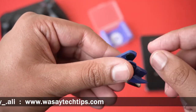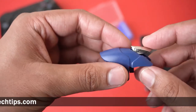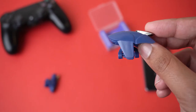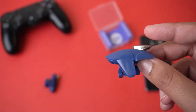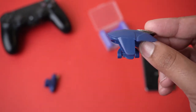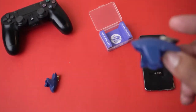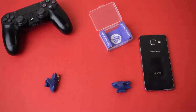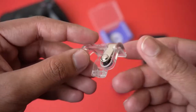As far as technology is concerned, there is no moving part on the screen side — we have a fixed side — whereas we do have a moving part on the trigger side. When we press it, it works on capacitive touch technology, meaning the screen gets a signal as if a finger touched it. So we have fewer moving parts compared to other triggers on the market.